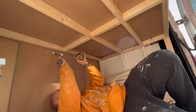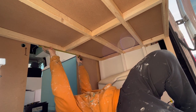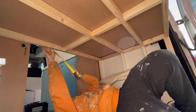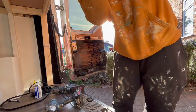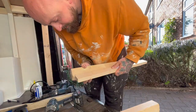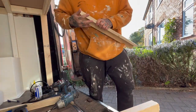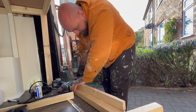With that made, I then moved on to the table holder in the camper van, which was housed under the fixed bed. This was a sliding timber rail made to fit the table in between. I made this so that the table slid in easily, but tapered down so that when pressed into place, the table was secured by a friction fit.